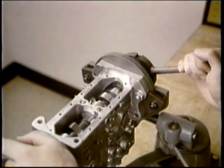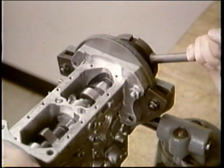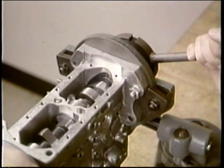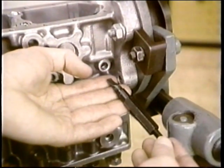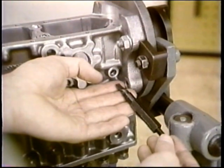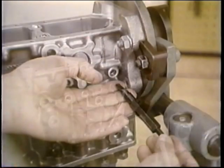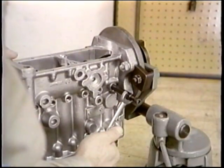Use the tool on the coupling to rotate cam lobe number one to fully depress the tappet to TDC. Back out the screw of this tappet holder tool. You're going to use a tool like this on most pumps to lift and hold each tappet away from its cam lobe. After you thread it in by hand, pull it up snug. But be careful — too much force will strip the threads in the aluminum housing.